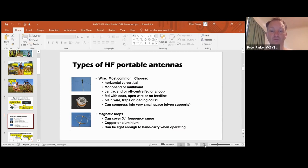So I'm now on types of HF portable antennas. Overall, for portable antennas, there's really nothing to beat a wire antenna for HF for small and light. There are a lot of choices - like horizontal or vertical, mono or multiband, the place you feed it, the feed line itself, and whether you can compress its size. Or if you're really limited on space but can tolerate more weight, then a magnetic loop could be an option, though there are some trade-offs. One can cover several HF bands and can be suitable for HF pedestrian mobile.